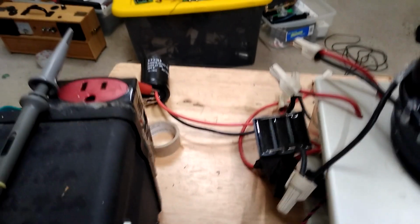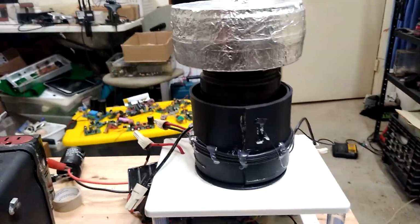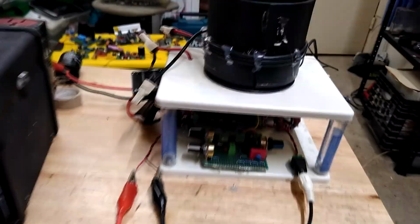the test rig. What I basically had going on here was I put a DC cap on there and I was testing it at DC. So I didn't really design that bridge down there to run continuous wave with a coil frequency of over 400 kilohertz like this one right here. I can do it for a little bit. It's not something that I'd want to have it set up for.